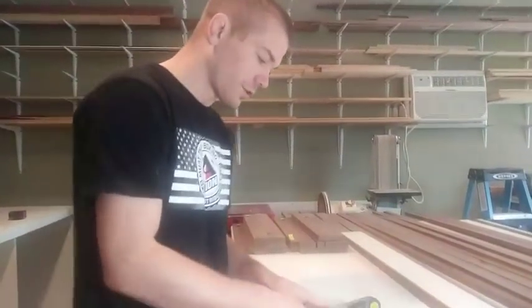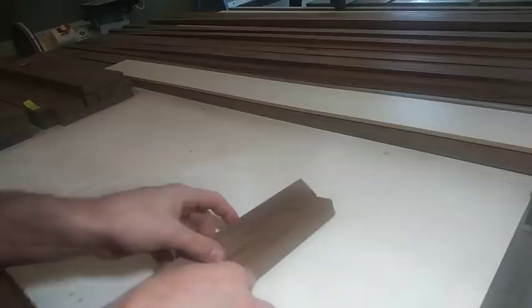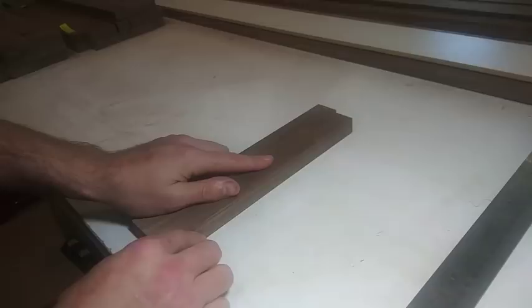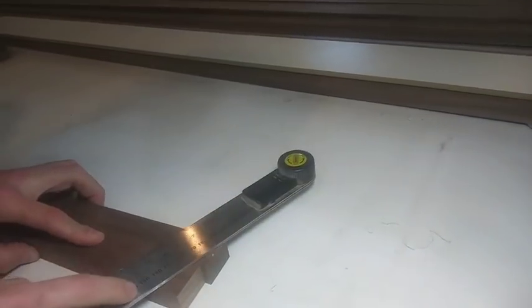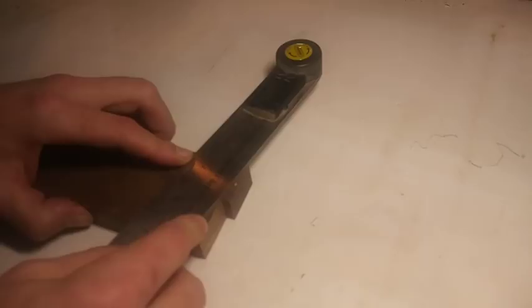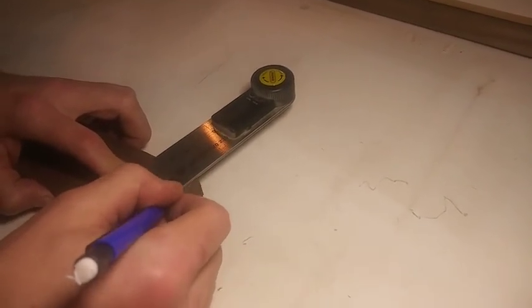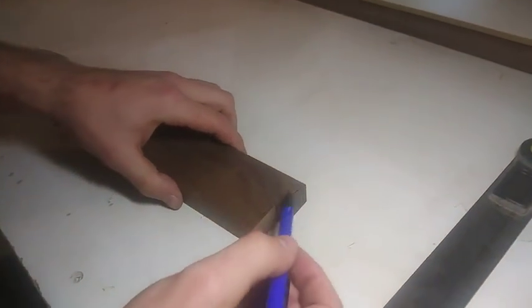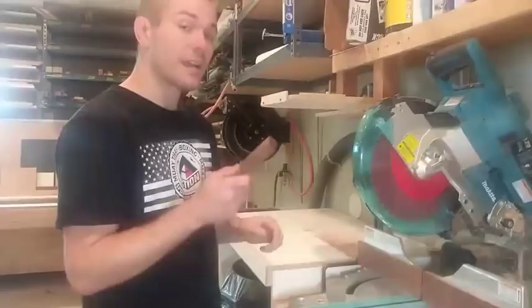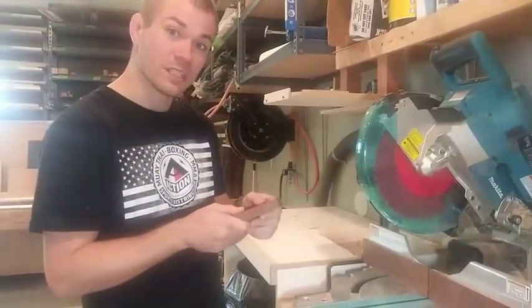Here we are on the workbench, and we're going to find that angle. This is an expensive angle finder, and I'm not even going to use it for finding the angle — I'm going to use it as a straight edge. We're going to take our pieces. This is the smallest face frame stile right here, and we are going to line them up at the bottom with our finger, because our finger is very sensitive and we can feel when it's perfect. I'm going to ride my straight edge along the high points — the highest point, which is the corner. Once I have this, I strike a line. Now once I cut this off, this is our correct angle. I'm here at the miter saw. You don't have to do this at the miter saw — I can actually do this at the belt sander or the disc sander and just work that to its line, and it's just as accurate.